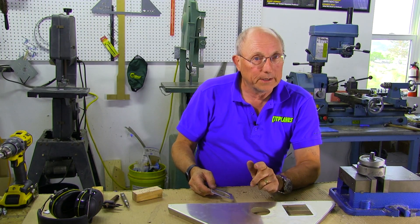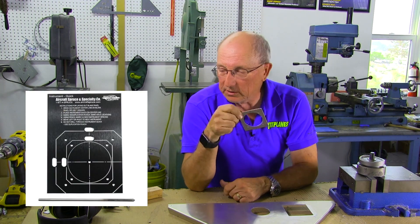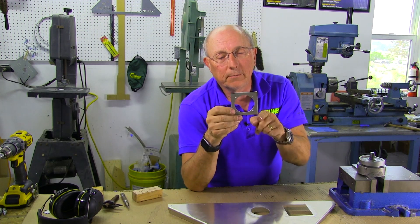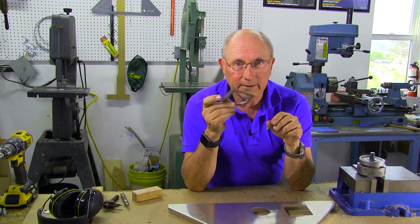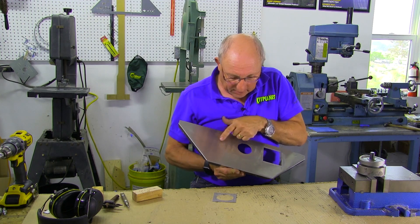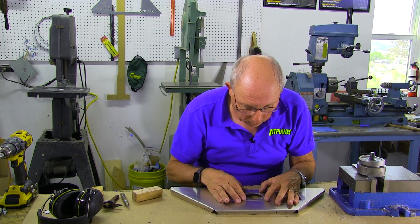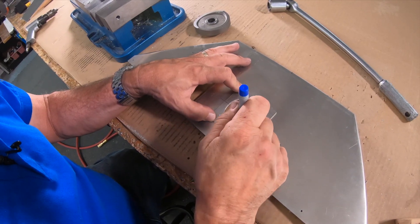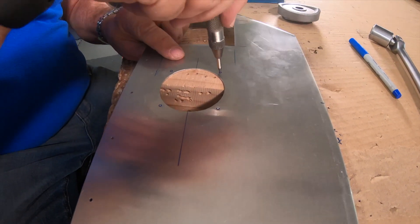Now that we have cut the hole for our instrument, we are not quite done. We still need to drill some holes for the mounting screws, and for that you need a little template. Sometimes these tools come with a template, sometimes they don't — if they don't, you will need to make one with very accurate measurements. Take your time. The holes are going to be on the diagonals and you will have to measure an instrument to get the exact spacing. Fortunately, I have a template. That template is already marked so I can line it up with the lines I extended on this panel for the center. It is simply a matter of lining the holes up, taking a Sharpie and marking the four holes — now we know exactly where to drill, and the instrument will mount up just fine.